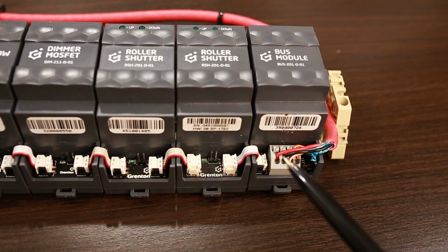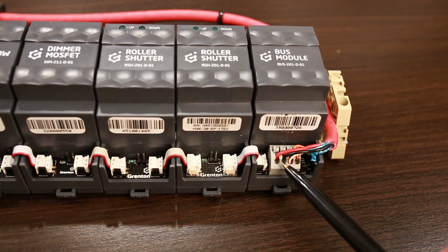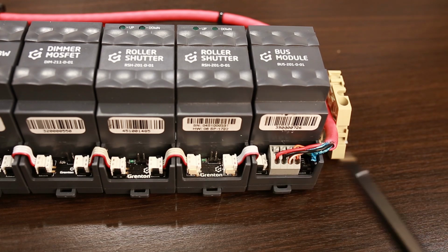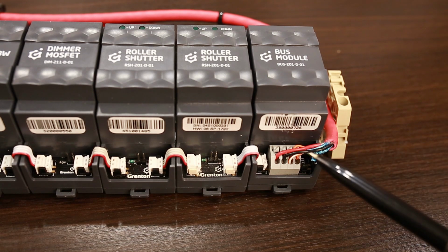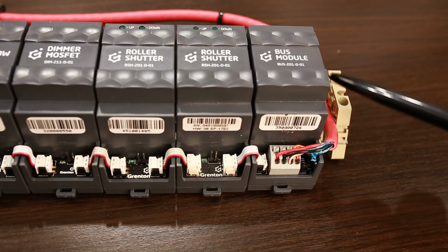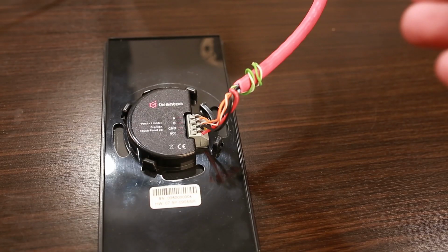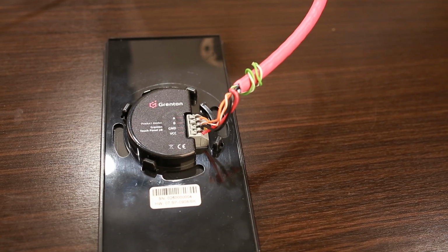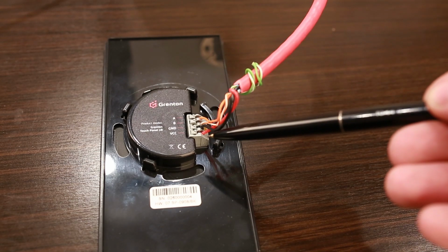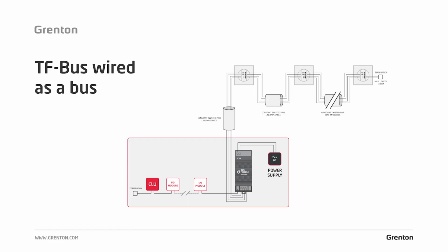On the one hand, we have a main connector which will be connected to the last module, and next to the connector there is a cable connection, typical for connecting wires. And now we leave the module with a cable and go straight to the first flush mounted module. All flush mounted modules are fitted with bolted or push-in fittings, so there is no need for any additional connectors or adapters. The main cable will be connected directly to the control modules or touch panels.